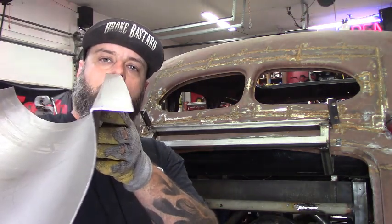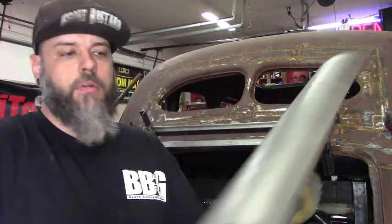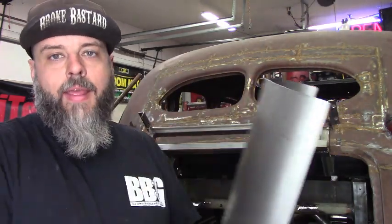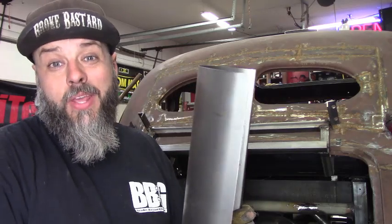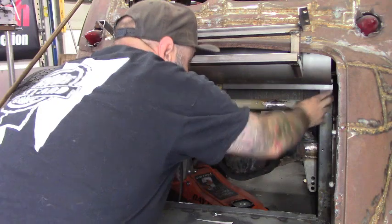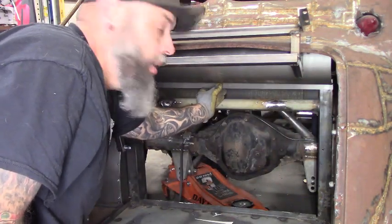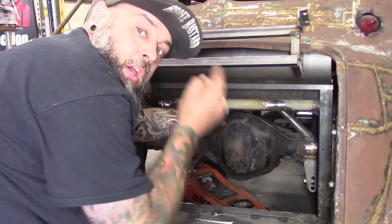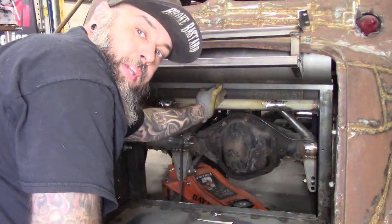At the bottom I folded a 90-degree bend and sheared it off at one inch, so this is our piece. I need to make a second piece because I needed 33 and a quarter inches and the width of my roller is only 28, so I'll have to make two pieces and seam them together — you're limited by your tools. Let's see how this one fits. Looks great, nice and covered up. Now I'll pull measurements and make the second piece, then put them together.